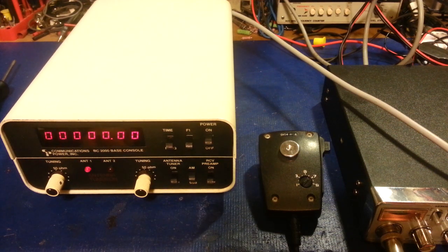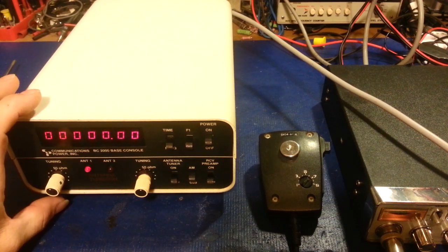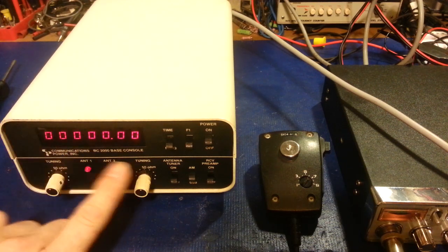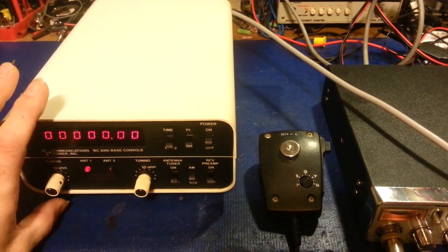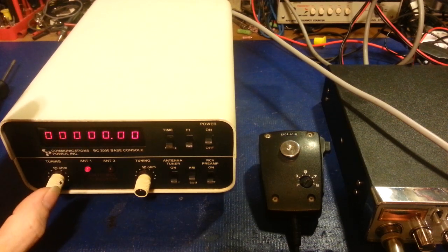But now, if you've watched any of my videos on the frequency counters, I said you have to let them warm up for a while because they get really hot and the frequency is going to drift. Their reading is going to change drastically over that temperature change until they get warm. This is no different, other than this takes a lot longer for the temperature to stabilize.